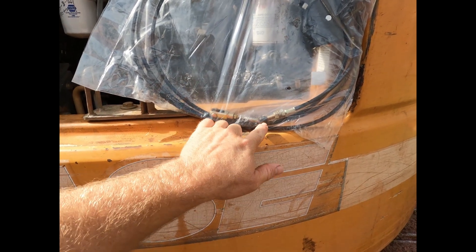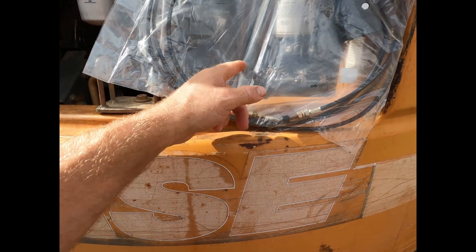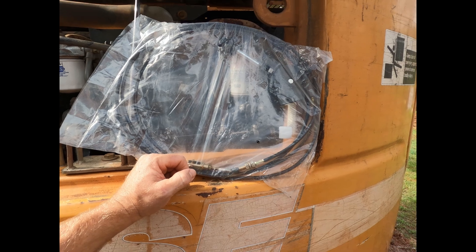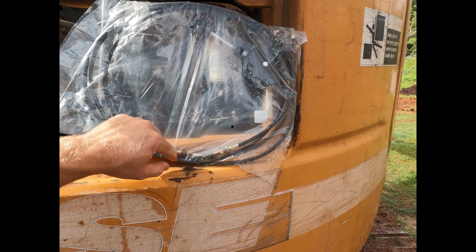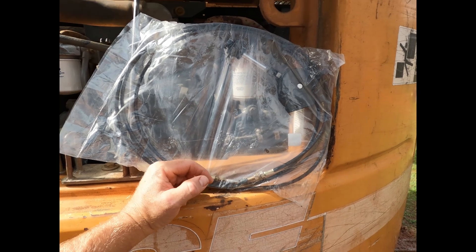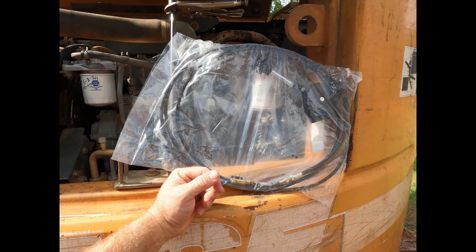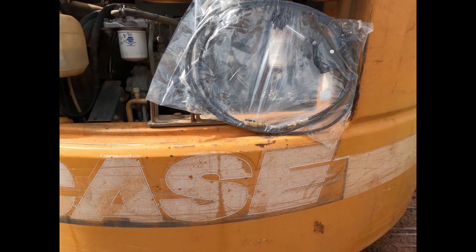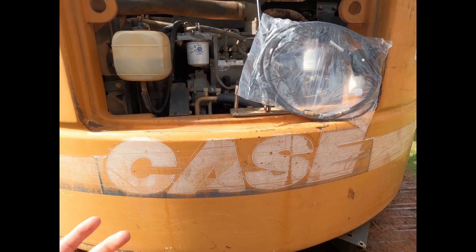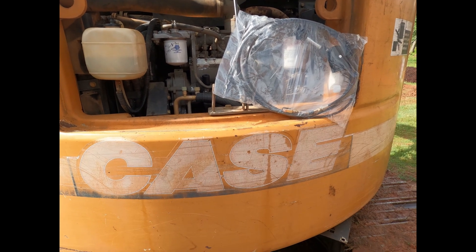There's a really good little clevis here. What I don't like is that there's nothing sleeving the cable back here where all the mud and grime is going to be, but we'll give it a shot. The biggest problem I'm going to have is threading this thing through the bay and finding a place to mount it up in the cab. This is an 11-foot one; my other cable in there right now is an 8-foot one. If you're thinking about it, I had the 8-foot in there and it barely barely makes it — that's why I ordered the 11. You could probably get by with a 10, but I'm going to try to be creative about how I route it.